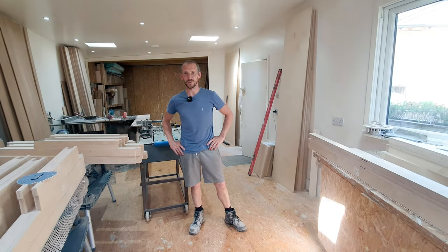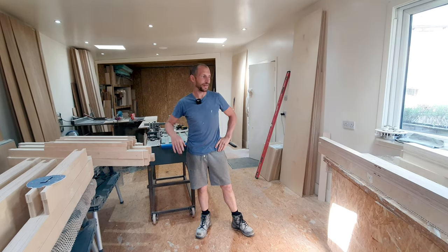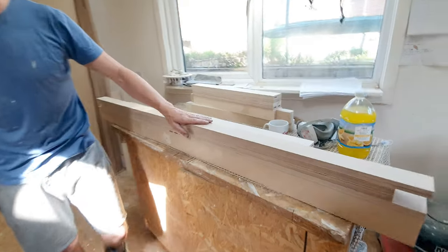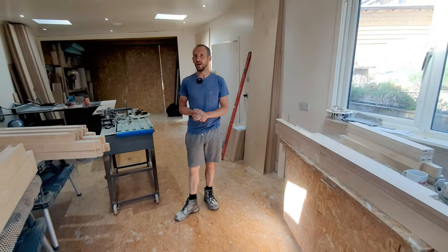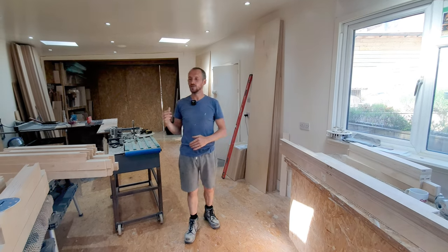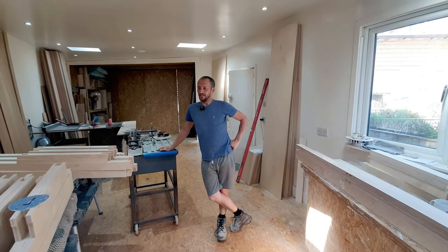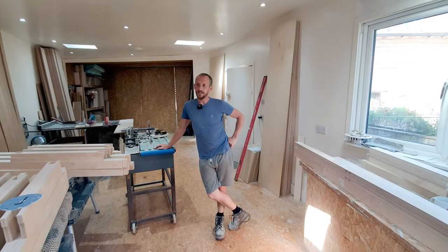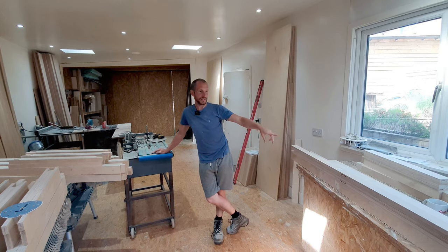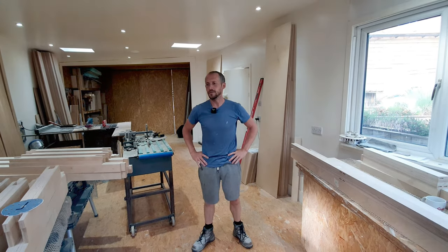So we've been working hard — or should I say Sean has been working hard. I've been dossing in the background doing some painting and measuring up while Sean's been here pinning and gluing 150 pieces of all these strips. We're at the point where we're gluing up. We've got eight frames ready to go, ready to clamp into their frames — two uprights, top and a bottom. Two have got a central division as well. We decided to go down the birch ply route because we can make the bench look nice. Birch ply is a lovely material — you can stain any colours, the edges look great, it's got a lovely grain, it's tough and anything laminated is absolutely solid.